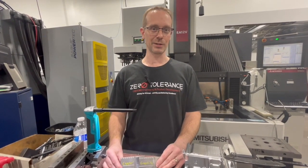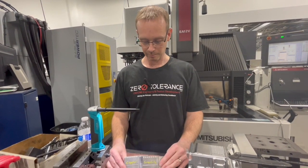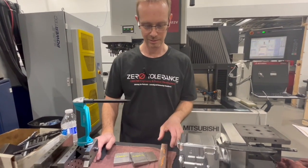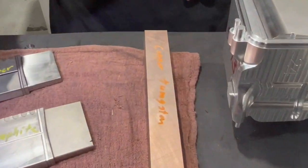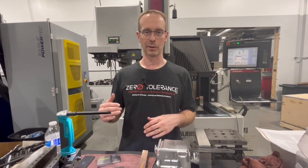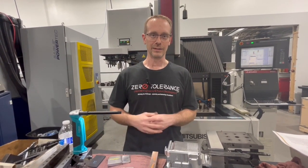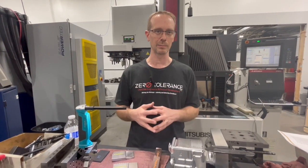I'm going to read you some technical information about why copper does not burn as fast as graphite. Let's also explore some of the other things about copper tungsten that we didn't discuss earlier. As you saw in our last episode, we had the copper settings for the copper tungsten and we didn't get a good result — we went from an hour and 10 minute burn with the wrong settings down to 44 minutes of burning, which is still almost double the Poco 3 burn time of about 22 minutes.